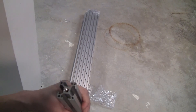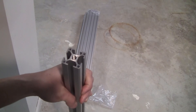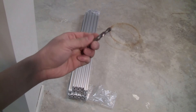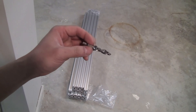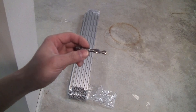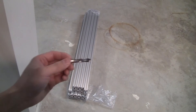The hardest part of this assembly is to make the thread at the end of the bar, so I tested it on the first one and it's actually a lot easier compared to what I thought. I'm going to use this M8 tap — it's very cheap, you can buy a set at Harbor Freight for about $10 and they work really well on aluminum. I don't know about steel, but at least for this purpose it works really well.